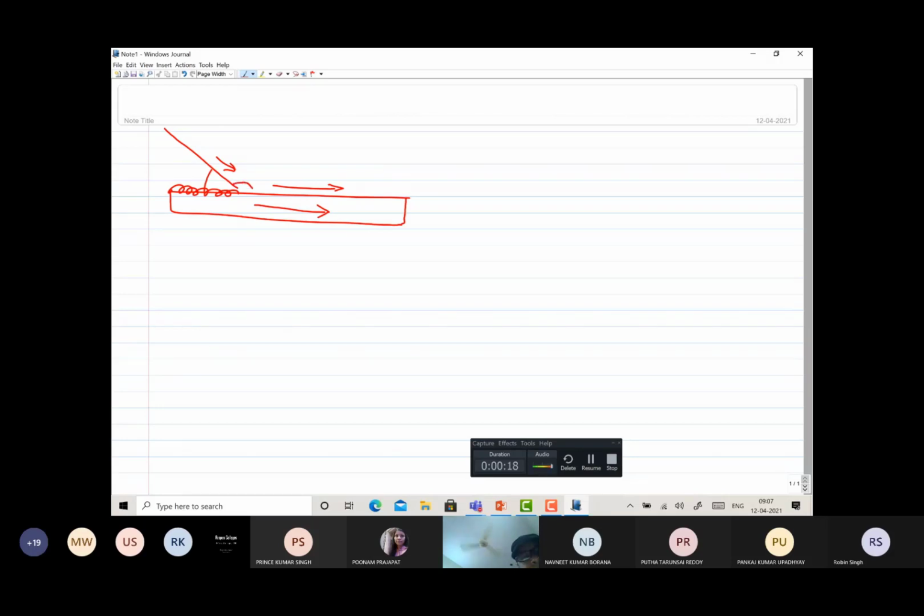When the flame comes out of the torch, it preheats the metal which is yet to be welded. So the one thing which is realized is the preheating of the base metal. There are many metals which are very crack sensitive because of high cooling rates. When preheating is done, the cooling rate is reduced, so the cracking tendency of those metals is reduced when this kind of preheating is facilitated through forward welding.